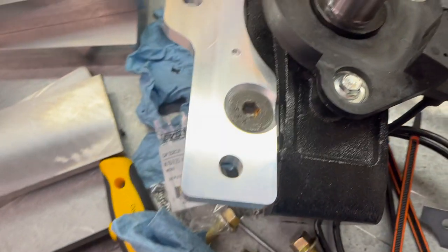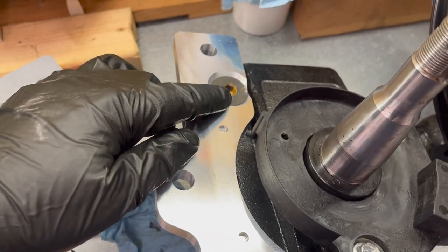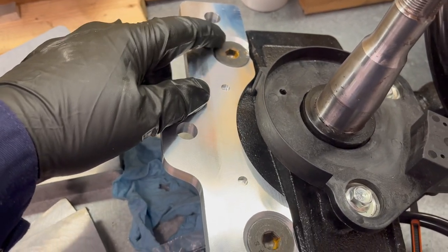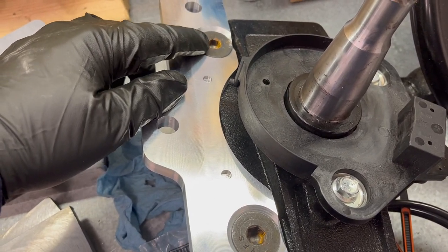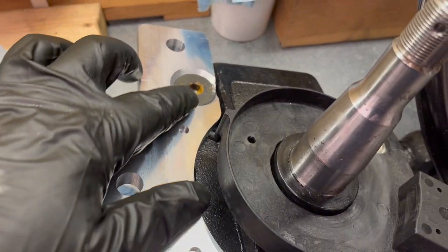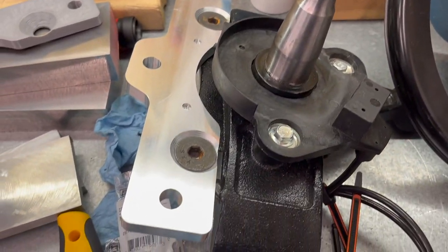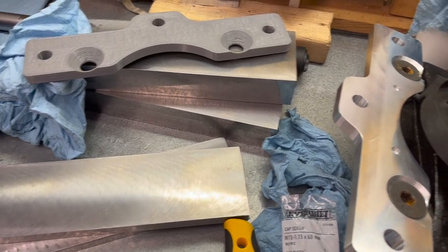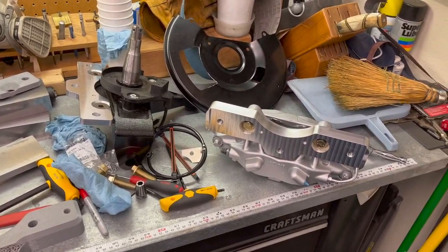And we got this other half on there. I'm gonna ask him, I don't know that we need those countersinks quite so deep. I think that's maybe an opportunity to lift those up a little bit, leave a little more thickness on that piece. We'll check on that. Otherwise, I think that's the only potential design change. See what the customer likes, and then I think we're about ready to move on to the 4140. Try these out. But there we go, a couple pieces done.